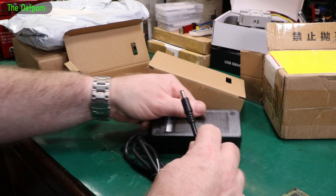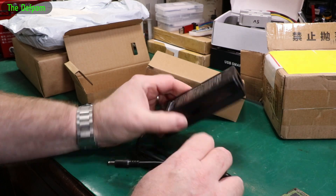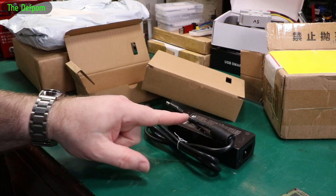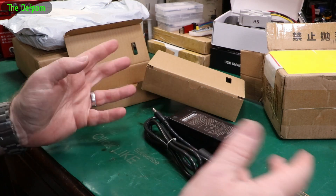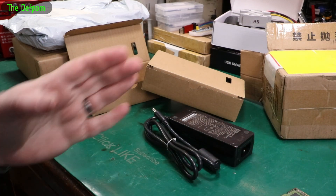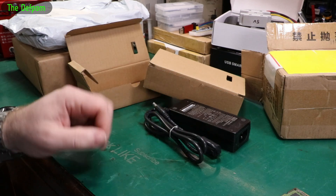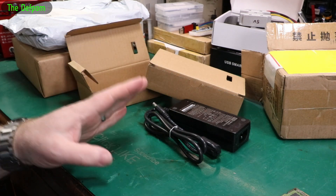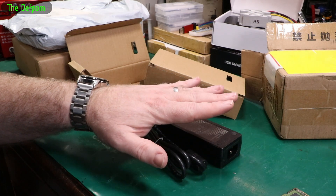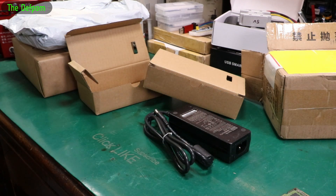I wanted Meanwell because it's recognized as a good brand and I want something reliable long term. 16 AWG cable, which suits the rating. I had two projects I needed to use these on. I've got a 10 amp brick currently in one of these things and it doesn't need a 10 amp brick. I like to build things over-rated — if I'm going to use one amp I might use five. I over-spec so things are not stressed, because if you stress them they don't last as long. I'm going to be pulling about two amps at most on what this is going to be running — less than half the rating — it should be fine.